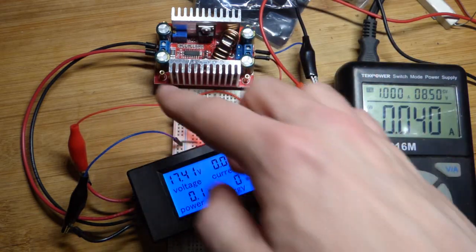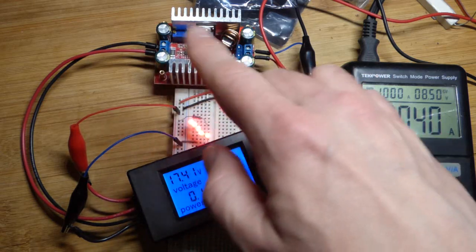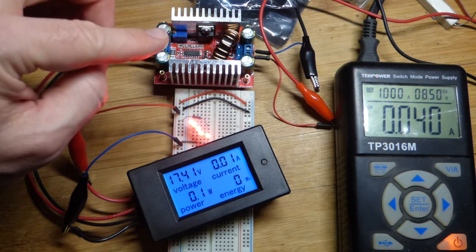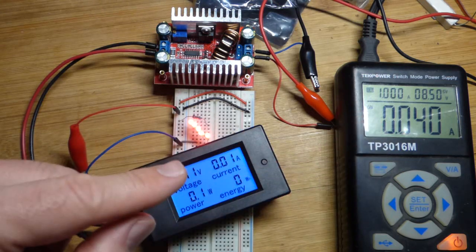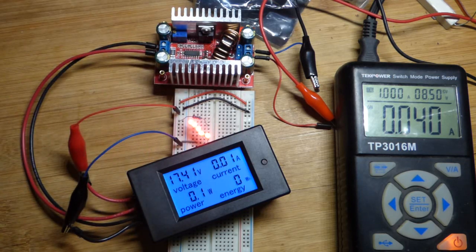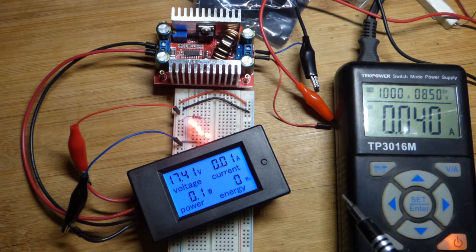You'll get to a limit sooner or later. I don't recommend fiddling with these more than you have to. I read a review where somebody turned the current trim pot too much and had problems. I'm going to limit my current with the power supply. When these fry, they deliver a lot of power and voltage, so for protection we limit current from the power supply.